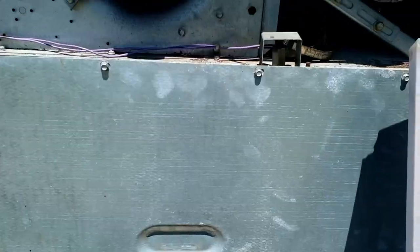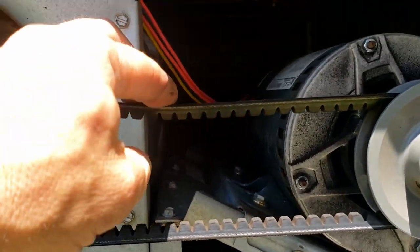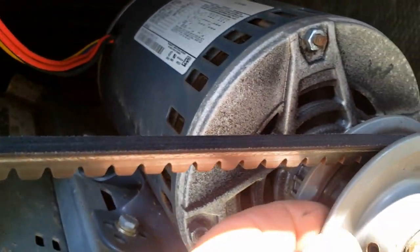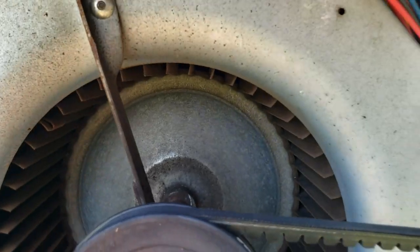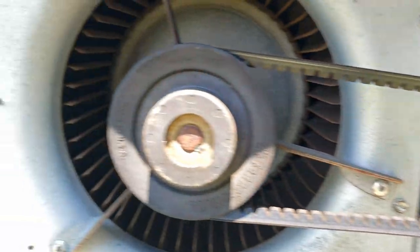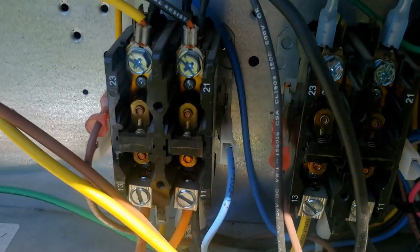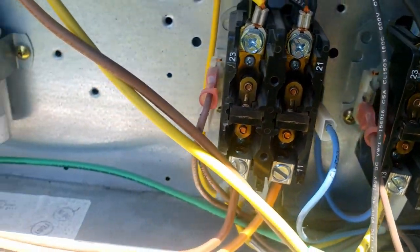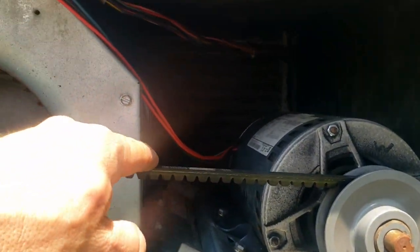Let's turn it on and see what it does. It kicked on — it squawked, it's not horrible but it's a little loose, a little bit of wear on the inside. The blade's not horrid, we're going to tighten that up. It didn't come on on its own right away — probably just jump it to speed it up. That contactor looks pretty jacked, we'll probably be replacing that.